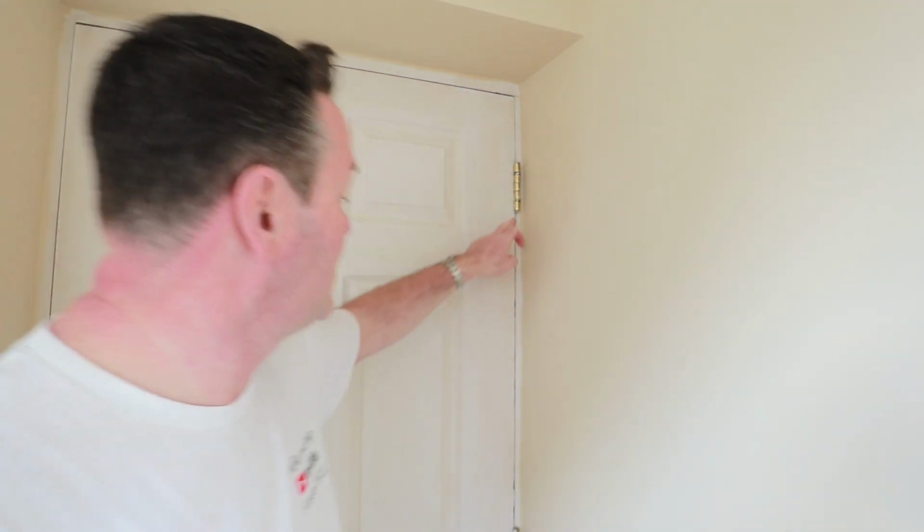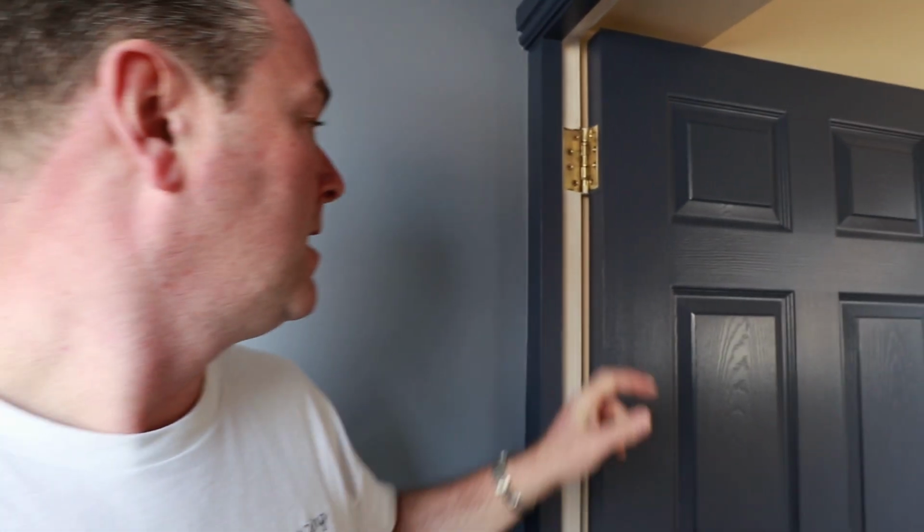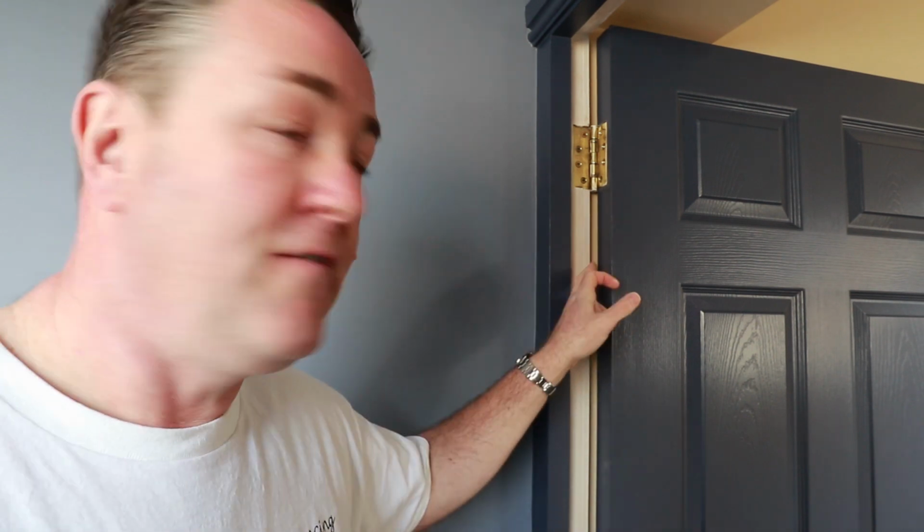You won't notice it. But because that door doesn't sit very well, the way the joinery work is, it's not sitting very well. What I'm going to do, and this is your anomaly, this is the odd occasion that you'll paint it differently. I'm still going to paint that door edge there, keeping the face of the blue clean, but I'll bring you into the room where I've got the hinge edge on this side of the room, and I've part done it because I didn't paint it blue. I painted the door edge blue. I'm happy with that, because when I paint the other side white, if any white creeps onto that blue there, I'll just have my damp cloth and wipe it off.